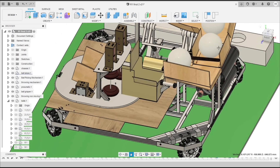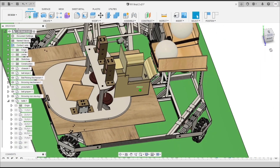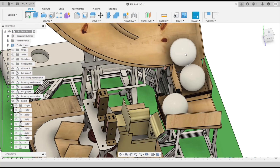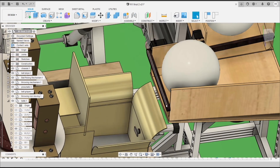The other end of this slope is open so that the R2 bot can align and pass balls from R2 to R1. While passing balls from R2 to R1, all gates of R1 are opened so the balls from R2 can pass accordingly. In the absence of R2, the balls slide down into the container and are shot — for this, Gate 2 must also be opened.